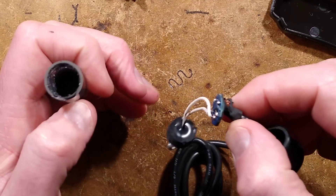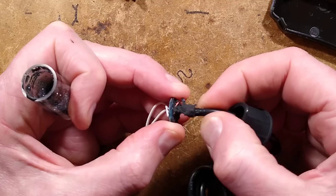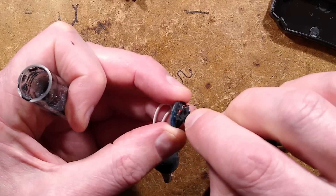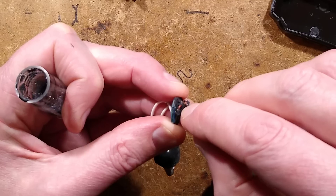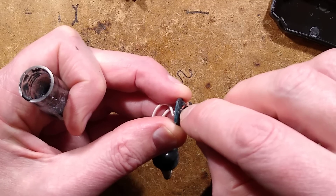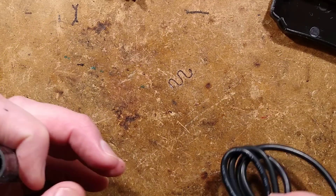Then there's a circuit board with the wires on it, and the main cable with four cores comes on. Under the silicone at the top that seals it in very tightly is a little thermistor — it's a 10K diode style thermistor. Then the wires going down to the heater. Very straightforward, quite a nice design really.